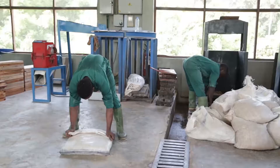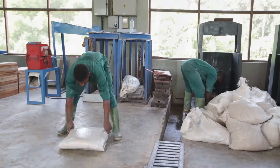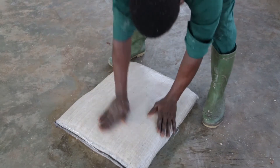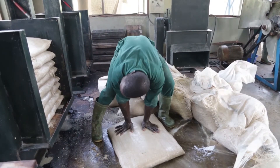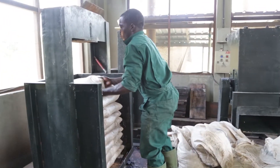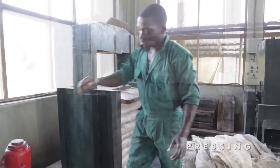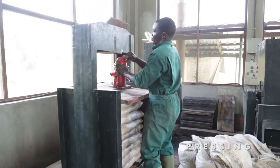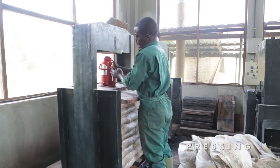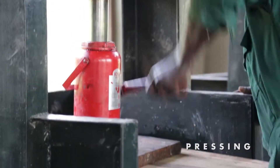Grated peels must then be packed in plastic woven bags in small quantities of 8 to 12 kilograms. The bags are then folded halfway and neatly stacked one above the other in a metal frame for pressing. A desirable stacking height leaves sufficient room for inserting a hydraulic jack. Wooden planks, which ensure the uniform distribution of pressure, are used to separate the stacked bags and the hydraulic jack.